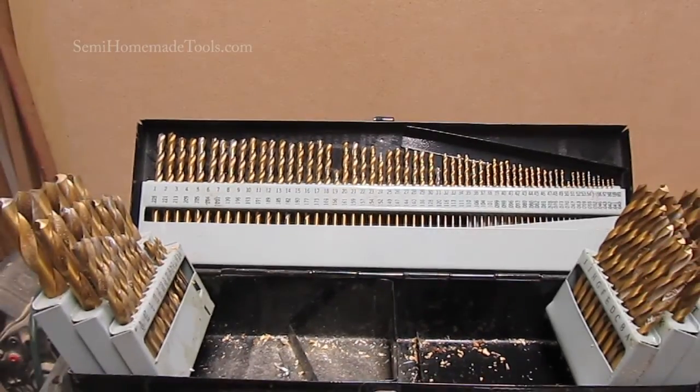For example, when you're going to do some tapping — let's say you're going to do a quarter inch bolt — you're going to have to drill that slightly under the quarter inch so that there's room to cut the threads and still end up with a maximum diameter of a quarter inch. Therefore, you have to use either a numbered drill or a letter drill, the one that comes closest to the actual size you need. We have a complete list of all the necessary tap drill sizes on the website, so be sure to go over there and take a look. You can download it and keep it.